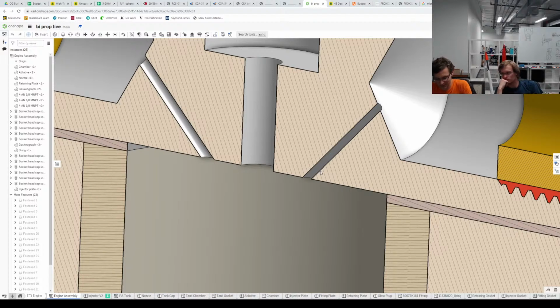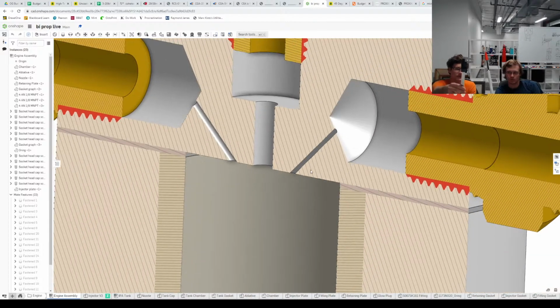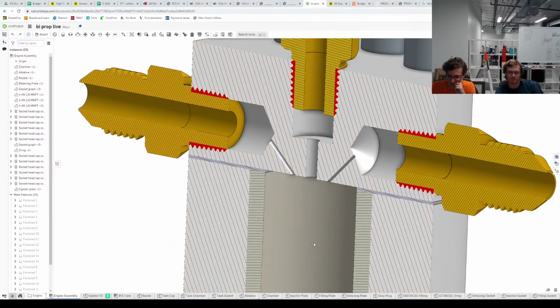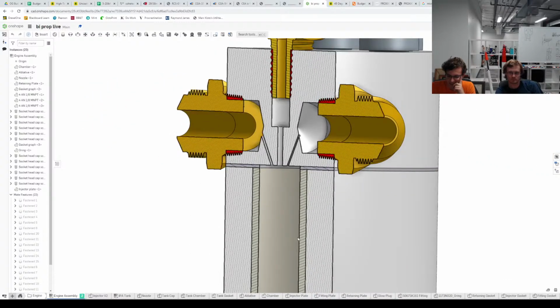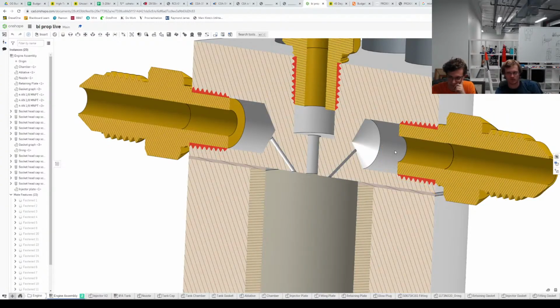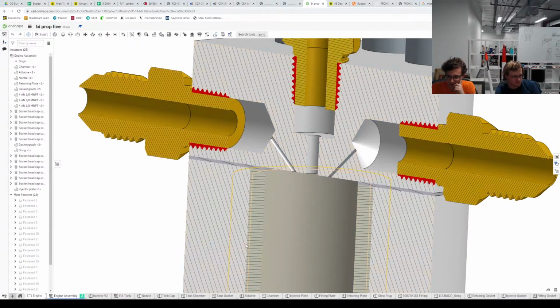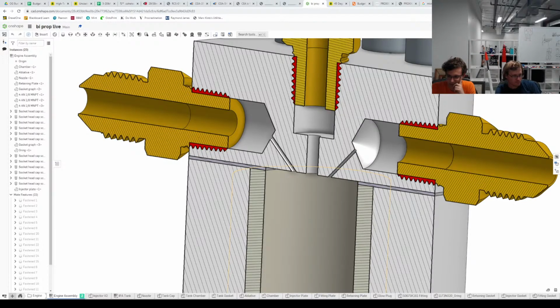That's not too bad. There's not a lot of meat there though. No, I guess it's not. It's not bad to drill, but it might not be a terrible idea, because I'll still be intersecting that thing down here. You might want to move these up so we actually have material down here. That's what I was thinking earlier, maybe that's a little thin.